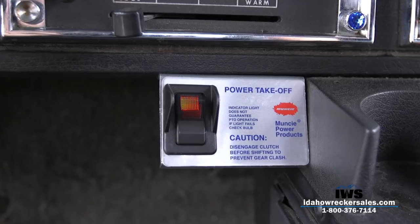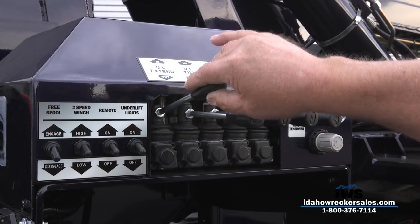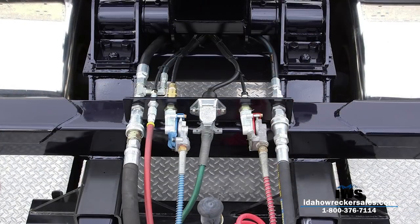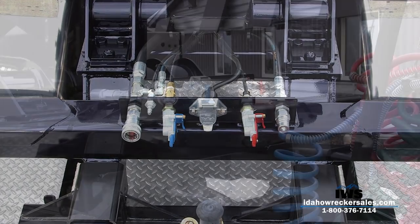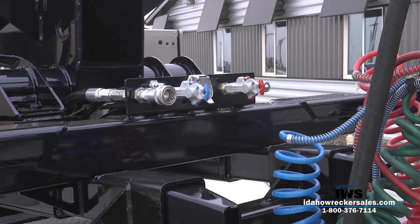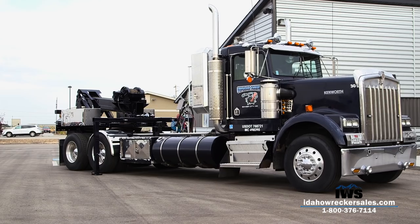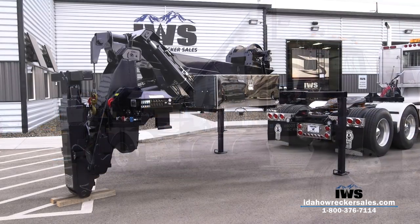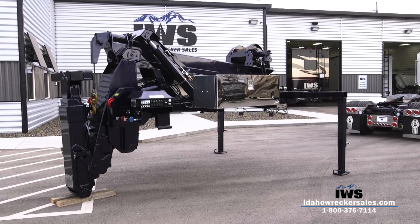Turn your hydraulics off and run a few handles to release the pressure on the lines. There are only two hydraulic lines to be concerned with — the pressure and return lines. Aside from the hydraulic lines you'll have a few air and electric lines to disconnect as well. Quick disconnects make it an easy process. Here we'll take a moment to give you a few examples of the DTU detached from the unit so you get a good solid look at it.